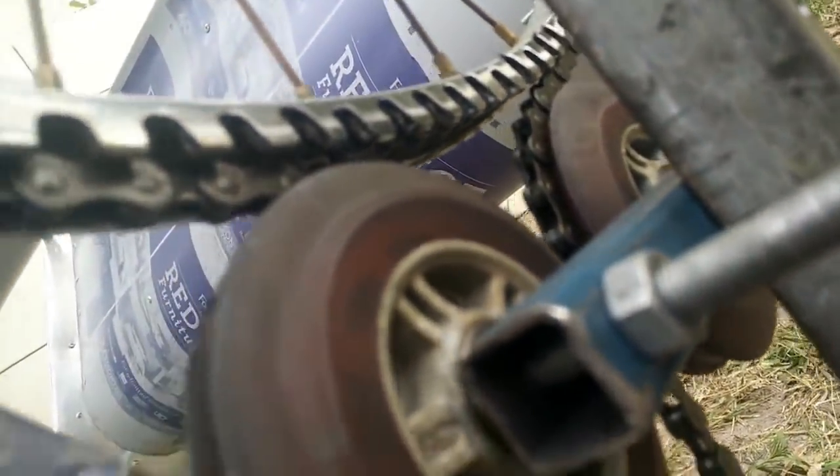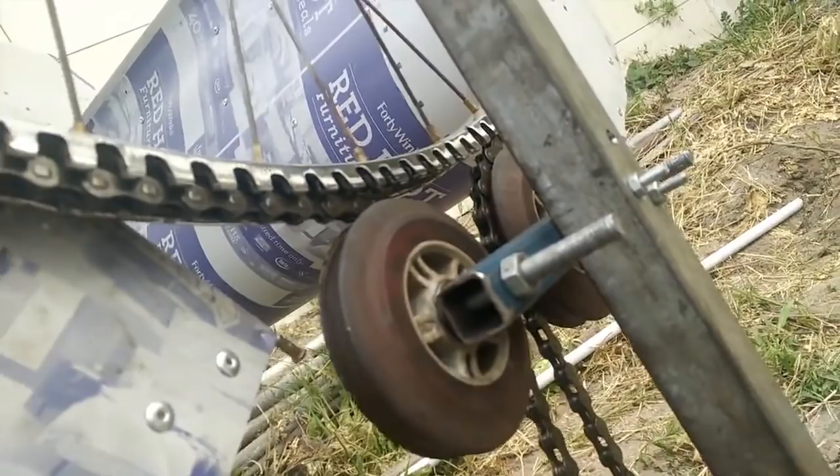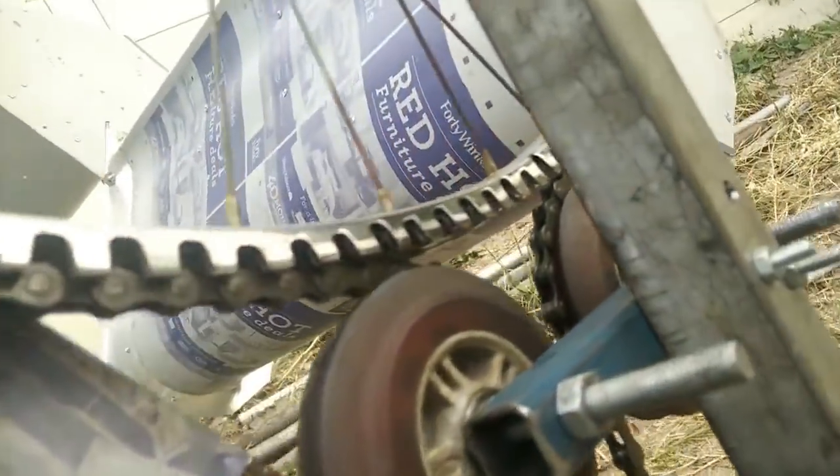And then this is like about a loop and a half — a length and a half of bike chain — wrapped around the wheel. And to get that to engage properly with the wheel rim, I've glued in a length of chain to the wheel rim, and then the chain engages with the other chain. Because it's the same spacing of chain, it grabs onto those like teeth.